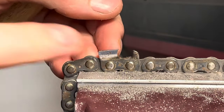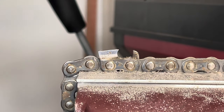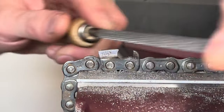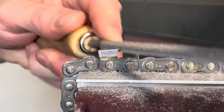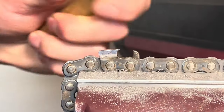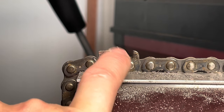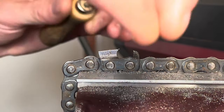Have a quick look. We're maintaining that C shape, we're not leaving any gullet there, but we've still got a lot more to remove to get rid of this damage. We'll continue. It's a bit awkward — I'm holding my hand up like this, so you have to bear with me, it's not my normal filing position. Quite hard to see here because you're in the way so I'm going to use your camera. A really nice C shape — we've removed the gullet, we haven't got too much of a sharp top or working corner, but we still have more to remove. You can hear it grabbing occasionally — it's because I haven't got this other hand to smooth.